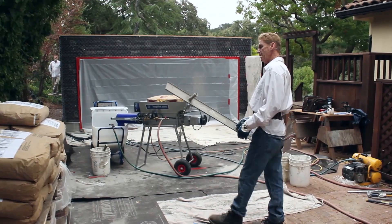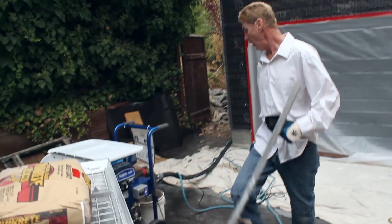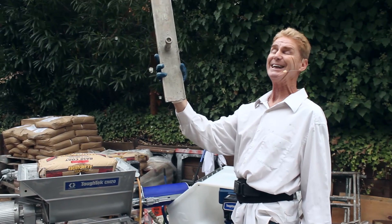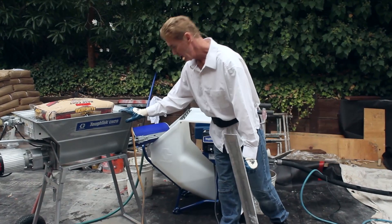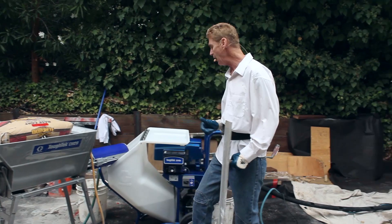Here's the mixer — this mixer is very strong. With a hose and the air hooked up to it, you can see the house here — the height from the gable is 20 feet, and this will pump upwards of 60 feet. That is mighty strong. We used to use pumps back when I was union, with a big tommy gun. This is almost as strong as a big tommy gun, and that's three times the size of this. What we have here is Graco's CM20. That is the mixer — you throw a bag on here, it adds the water by itself, so you get a perfect mix every single time.